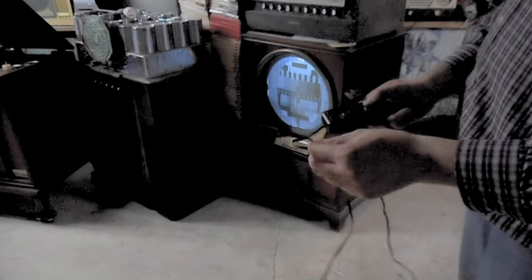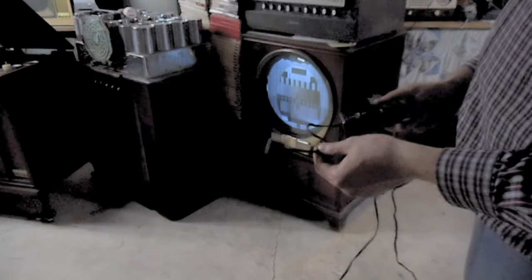But Tom, it's not a proper cheater cord if it has a normal outlet plug on the end. A proper cheater cord has the correct pins to go between the back of the TV and the interlock on the chassis like this. Fair enough. I know I've got another one of these somewhere that also has the standard small pin interlock that later sets into the 80s used. I don't know where it is right now.